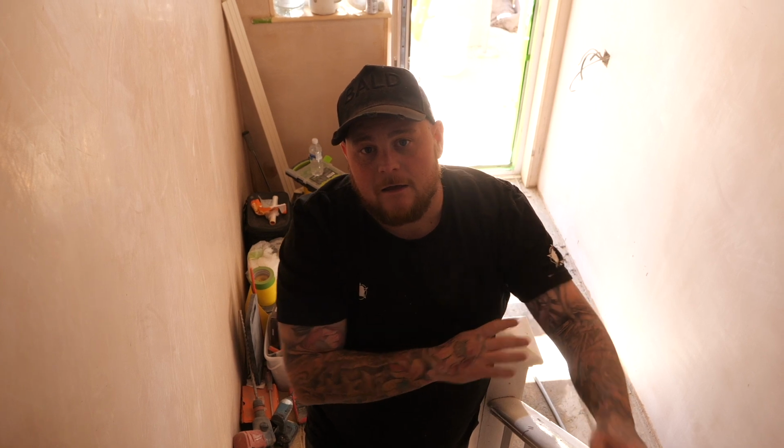That is how you lay K40 HB by ARDEX. Obviously we've only done a small area there. If you're doing a bigger area, you're going to want to make your buckets, get them down. The drying time is about 4 hours to walk on, roughly. It seems to be about touch dry about 2 hours though, doesn't it, Brad? Yeah. 2 to 4 hours before any foot traffic.